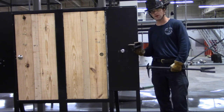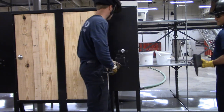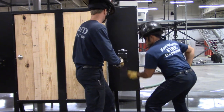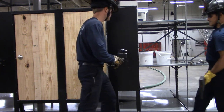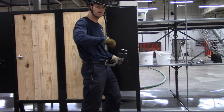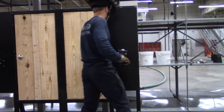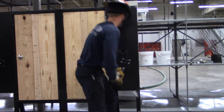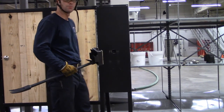If we approach from the bottom we pry down; from the top we pry up. Take your iron, set your tool, and strike multiple times. A lot of times we can weaken those screws more if we give it a slight left-and-right rocking motion and then pry it down. Go left a little bit, then right, then pull down - and we've got it. Take our screwdriver and manipulate that lock.